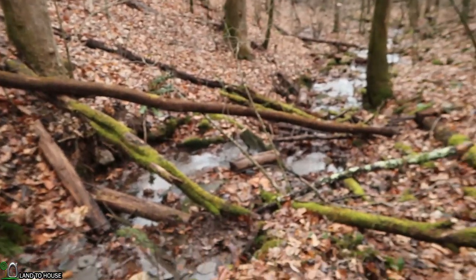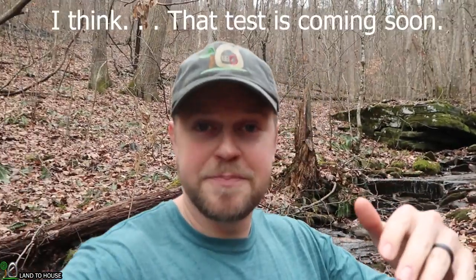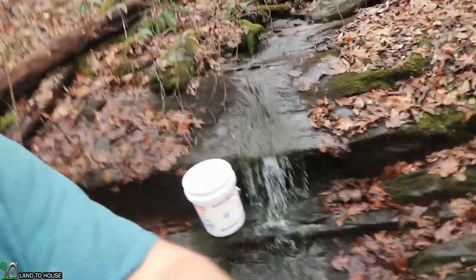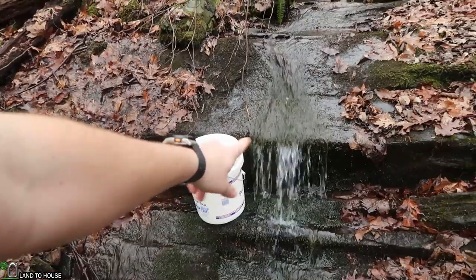I'm here on top of my mountain, which has a nice-size creek running through it. From right here down to the house is about 210 to 215 feet of drop — that's called head pressure, and the flow rate is what we're here to test out today. It rained a little this past weekend so I'm expecting this to be a little higher than it would be in mid-summer. I want to get some year-round tests of flow rate, and I'm going to use this same spot each time because it's pretty easy to access this little waterfall here.